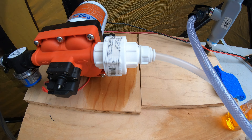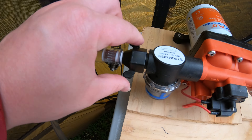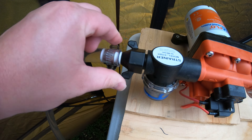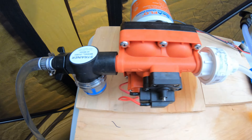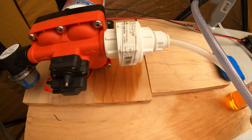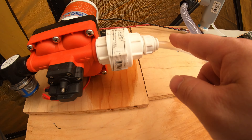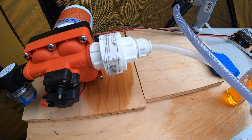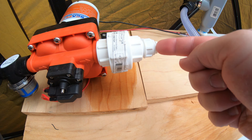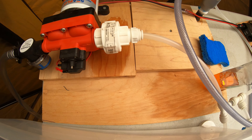Over here I've got an adapter — we've got half-inch threads. I need to be able to disconnect the plumbing from the pump, so this has some little wings on it that I can use to just twist and take off the intake hose. And then this is just one of those compression couplings I found on the sprinkler aisle at Home Depot — that allows me a quick disconnection at that point. And then I transition to these press-in and lock-type tubes. Push this little collar back and the hose pops right out. So that works really well to modify or change or replace parts as needed.